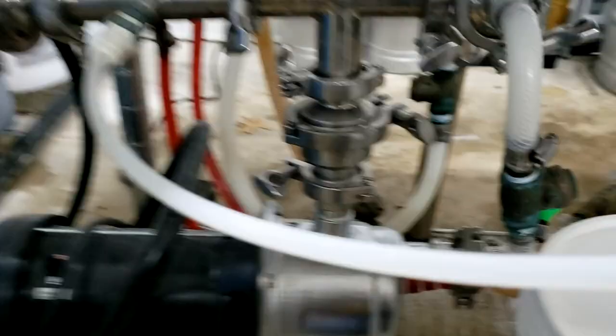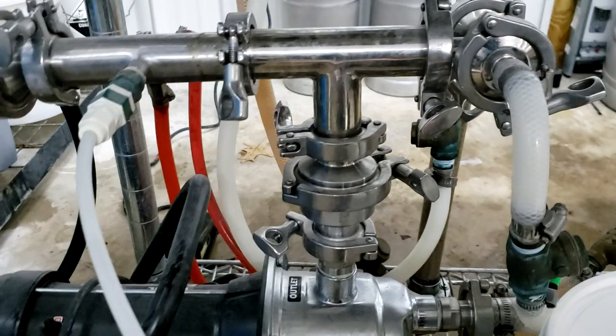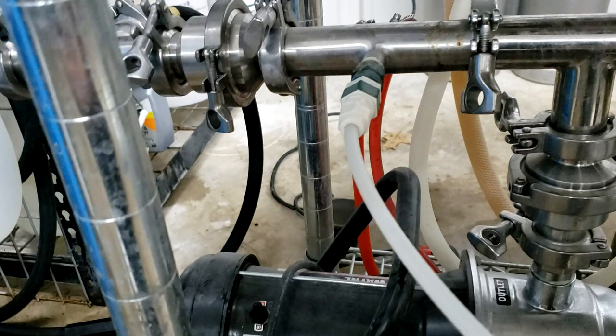You can see it goes from the pump right into a check valve, then it comes up into a T here. The T branches off over here — this is our injection pump for our acid, and it also has our air and CO2 lines hooked to it. All of these have check valves built in, and then there's another check valve on the end. Then it goes into another T and this is our hot and cold water inlet.